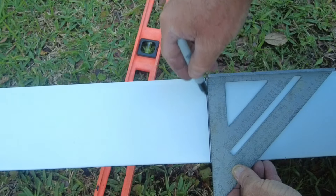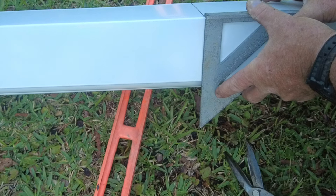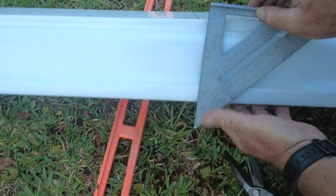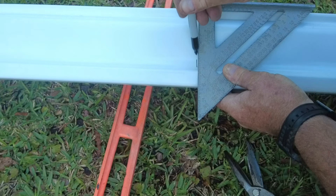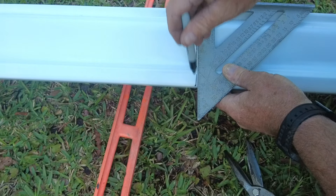But I don't, so I'm going to show you what I do. Before I can start cutting, I need to know where to cut, so let's make a line all the way around this. I sort of work my way around the gutter with a square so I can try to make the best straight line I can. This section is the hardest to mark because the tin gutter has a curve to it, and then I'm going to get my tin snips and do my best to cut along that line.